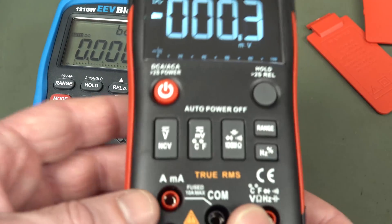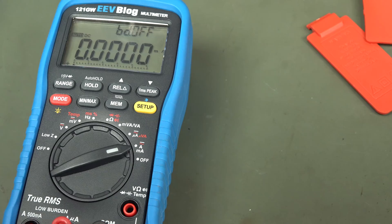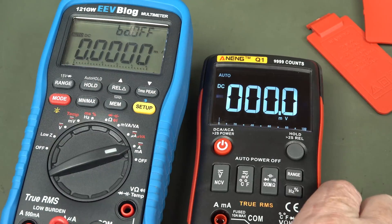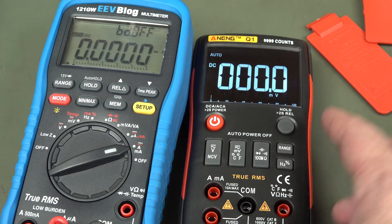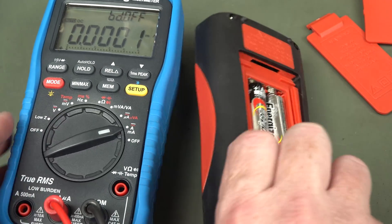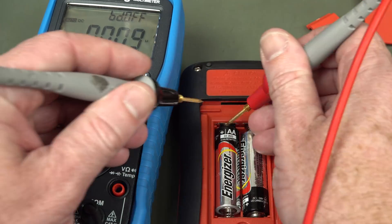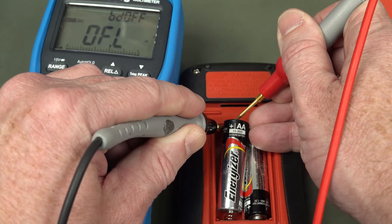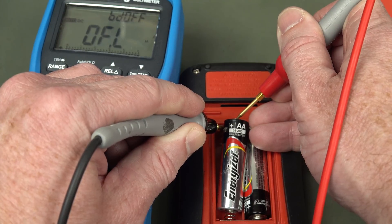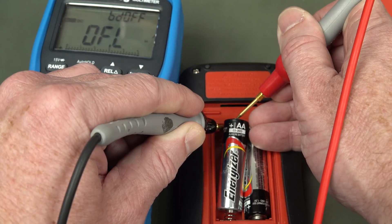And there's a relay click when you turn this thing on. Listen. There's a very distinct relay click, which they probably have to do because it doesn't have that range switch. And interestingly, if you try and measure on microamps, check it out — you can hear it going tick, tick, tick, tick — it just oscillates, because it can't actually drive that relay on power-up.